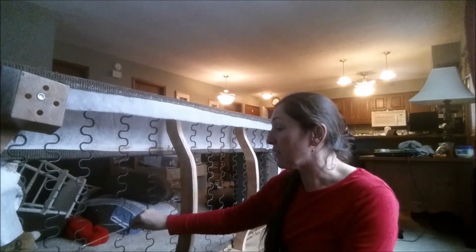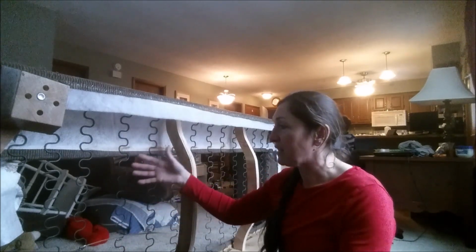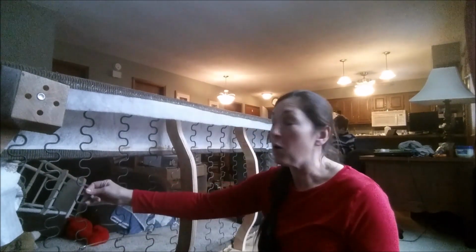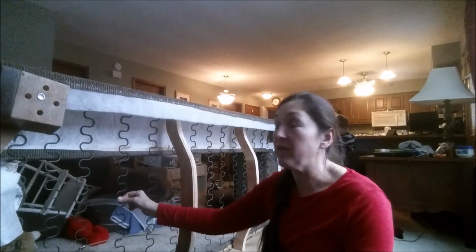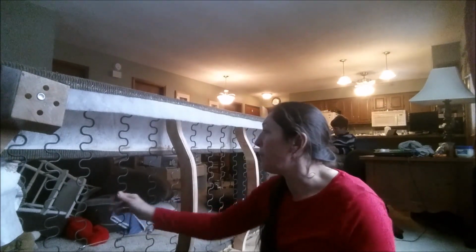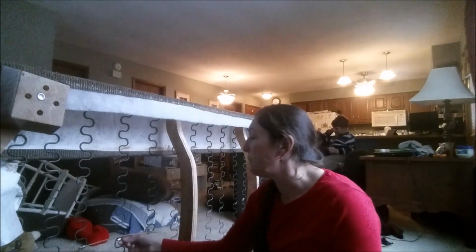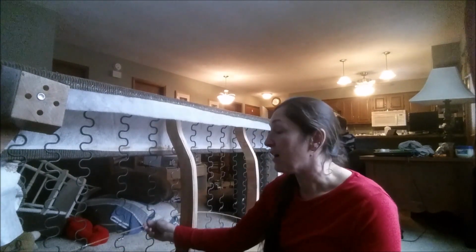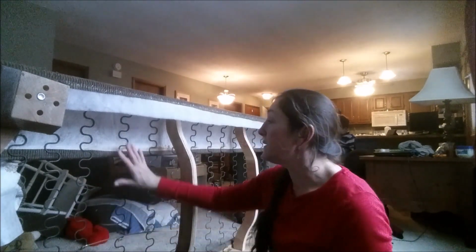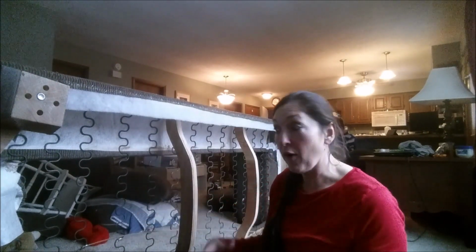That's not a lot of extra support for your up and down coils, and these are a tension coil. They're very, very curved, and I actually just was straightening this one out. You can actually have these snapped in half, and on our chair that I have been reupholstering, I had one snapped in half, and you can get another one sent to you. I will put a link in the description below for some of the products that I've used for this, but the clips that hold this on are essential for keeping this in place, and that's going to help tie together all of your coils that are supporting your cushion that you're sitting on, keeping you from falling down into it.